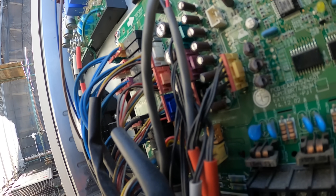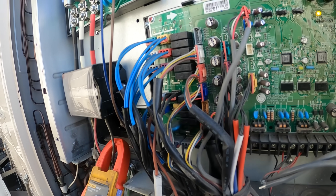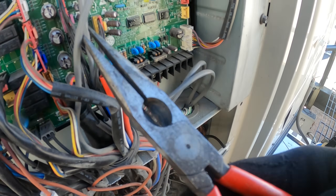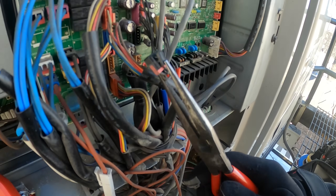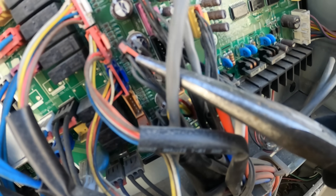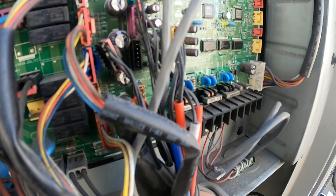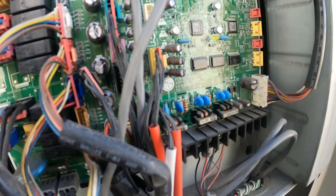I only see two sets of wires on this thermistor. Something get disconnected? We've got to take a further look. Just turned off the disconnect — I'm going to give it a few minutes to power down. There are two sets of two wires. It shows DISC-2, SCN, and HXL — to me that suggests three thermistors. But I think because they use this same board for different units, this unit only has one compressor. DISC-1 is your discharge line — it says C-1, so it's only one compressor. So there are only two thermistors in this unit for this plug.